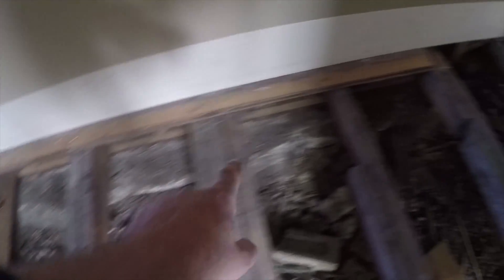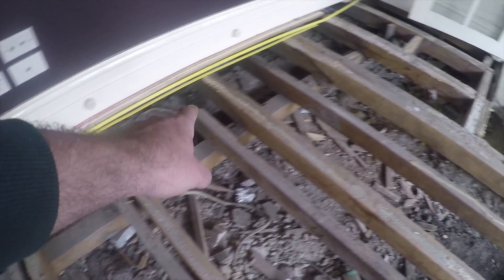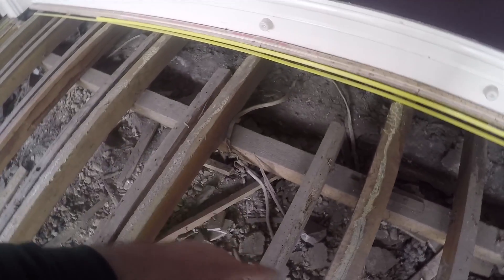In the hallway we've got all of this strip footing — bluestone — all the way through. Here we've got bluestone. Look at this: a bit of wire just stuck on the floor. I always talk about — you've probably seen in a video before — if you do a renovation or an extension and you are not sure about the wiring, get it cut off by a registered licensed electrician. For the safety of anybody and everybody that works on site, all the electrical's disconnected. I don't have to worry about it at all.